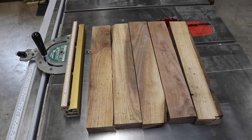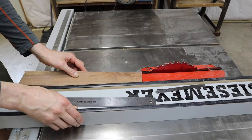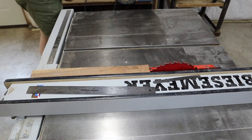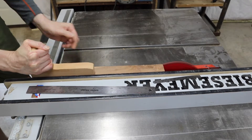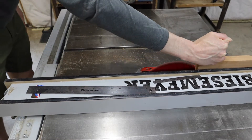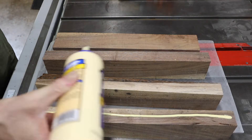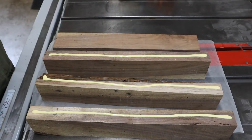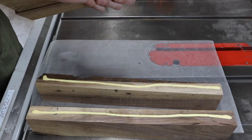So I cut them to length roughly, giving myself a bit of extra, then ripped just a sliver off each one to straighten them out. These planks were originally cut when the table saw was askew — it had been in a moving container which experienced an emergency stop, so I was told. This event was significant enough to tip the saw over onto another machine inside the moving crate. The truck must have quite the brakes to unbalance and tip over a 180-pound saw. I had thought it was fine, but it turns out that the blade and the miter slot were no longer parallel. Now it is fixed, so the planks will glue together nicely.